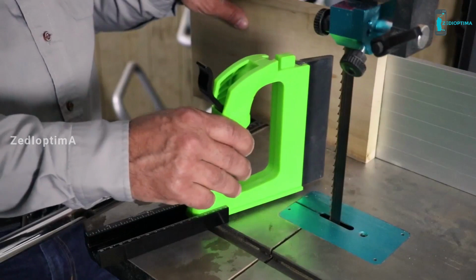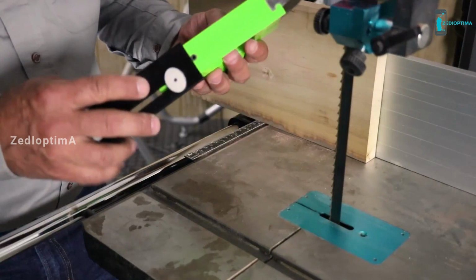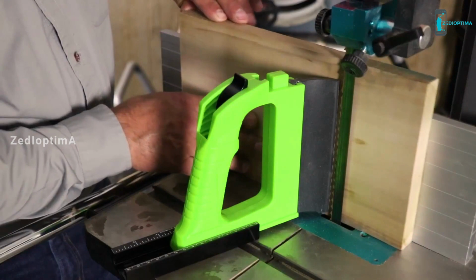It's important to note that if the Guide Pro is not locking, the lever shaft may not be within the base. The lever shaft has to be within the base for the lever lock to work. Following these steps will allow you hands-free feed and provide consistent hold through the entire process.